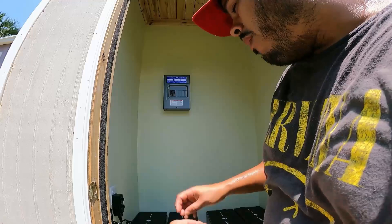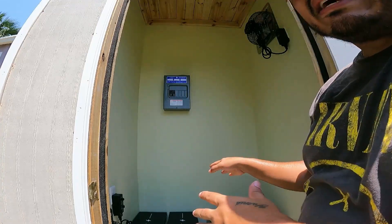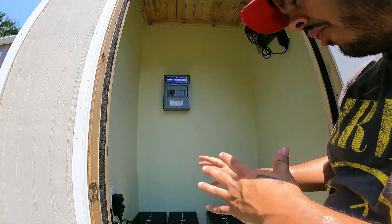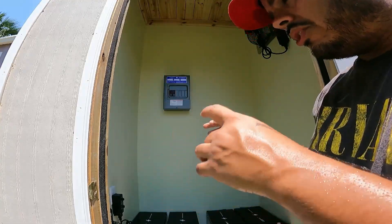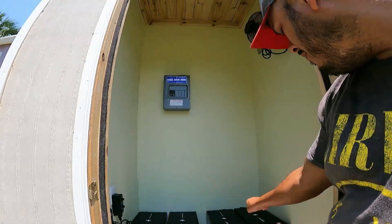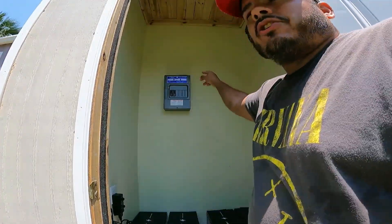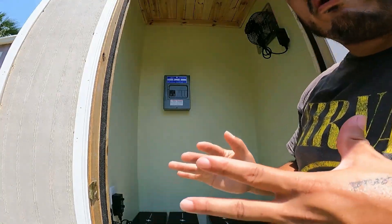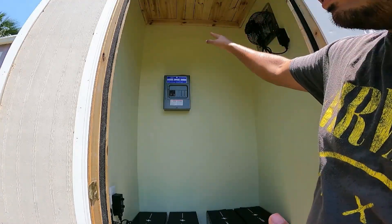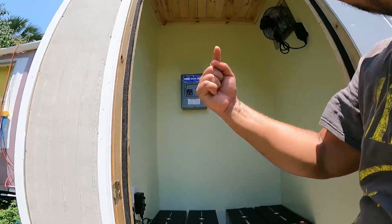Right now what we're doing is connecting these batteries — they're not connected to the home yet. I just purchased these off Amazon for about $375 per battery, so about $1,300 to $1,400 total. We'll connect them together at the correct voltage to match the ones inside the house, build the secondary shelf, run the negative and positive wires on top to connect to the secondary stack, and then add the supports for the Victron Quattros. The Quattros are about 70 to 80 pounds each, so roughly 150 pounds total — we'll mount them to the board with a metal base plus wood for support.